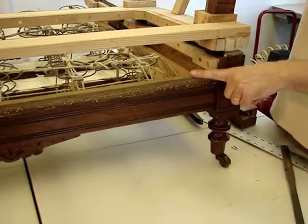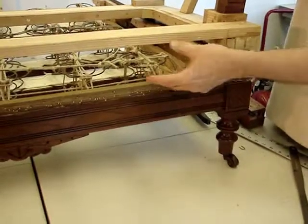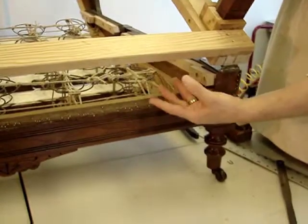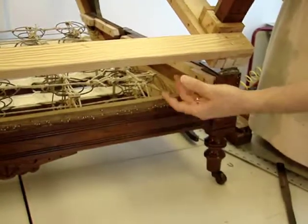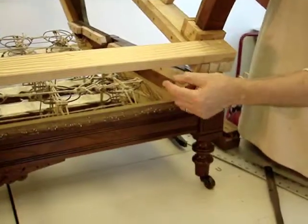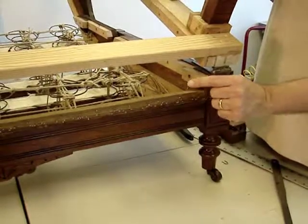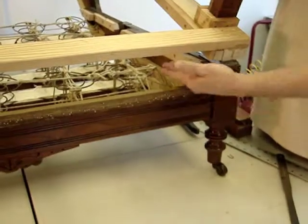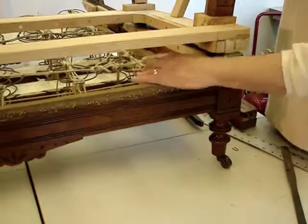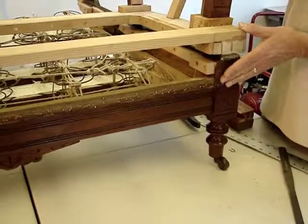It's going to get a little bit dicey because all the stuffing that's tacked or stitched into this band is going to have to move up into the structure as it deploys. And so all that stuffing that's out here is going to be squeezed into a section that's about so big, without any additional infrastructure — like elastic or ties — that would automatically pull it back toward the springs. So you're getting to walk in the upholsterer's shoes who was handed this frame.